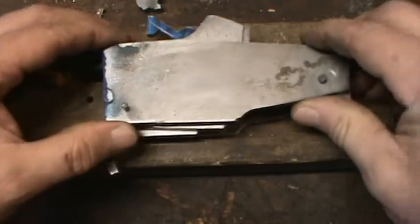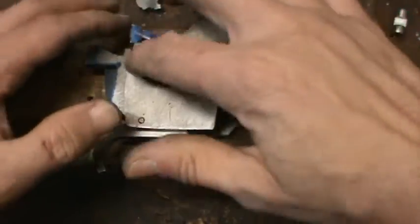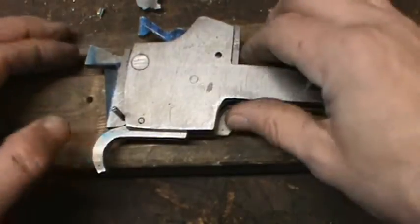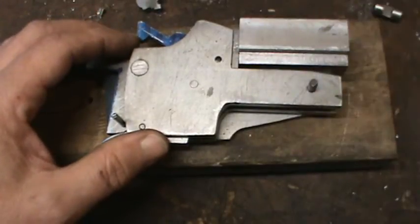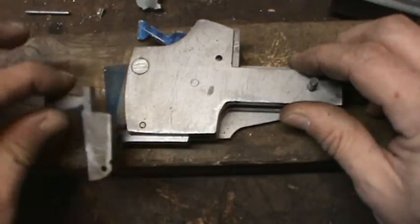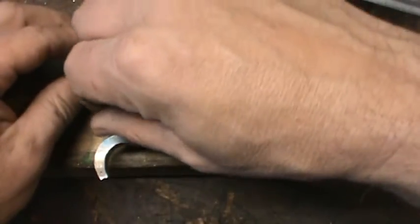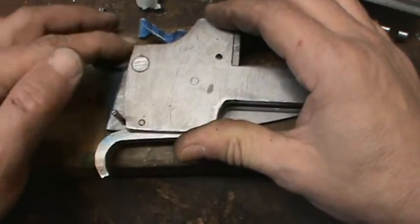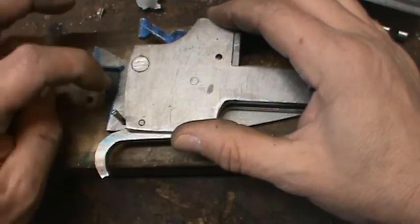It's slow going trying to fit all this. Not any real updates to the insides. Made the locking bar — the first one I cut way too deep and had way too much play. It really can't be fitted properly, this piece and this piece, until this is welded in there, and that's going to be a little while off. So I may end up having to make a new one of these with this being taller. Getting some interference also down here between the trigger and this — getting kind of a camming action — but all this is going to change whenever it gets all put together and fitted up. I'll probably end up having to make another one of these.